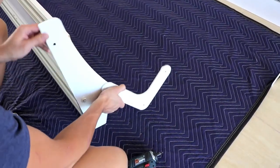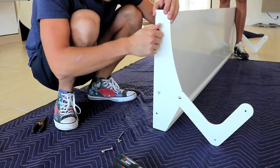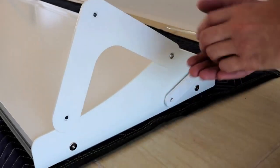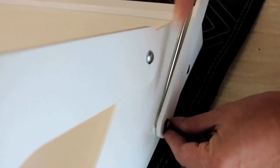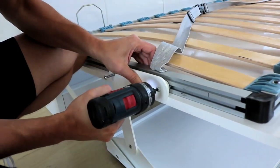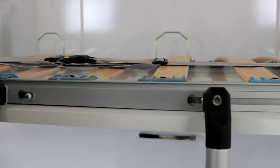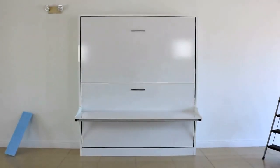Secure white curved brackets on both sides of panel L. Place in front of bed and attach to supporting arms on either side of unit. Use part SG01 to secure the supporter. Secure white curved bracket to metal bed frame using provided bolts. Use brackets to install the ladder. You have now completed assembling this unit. Thank you for watching.